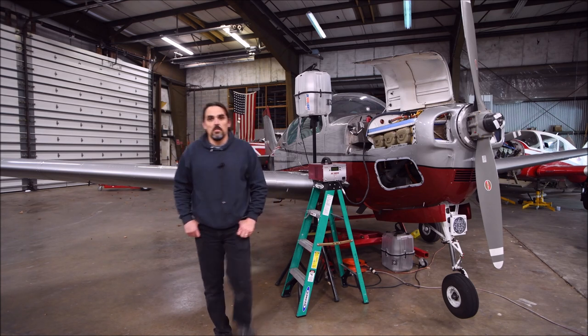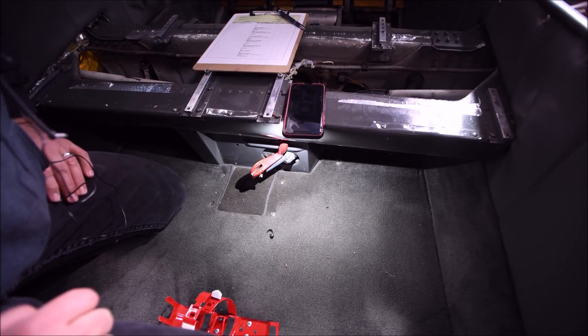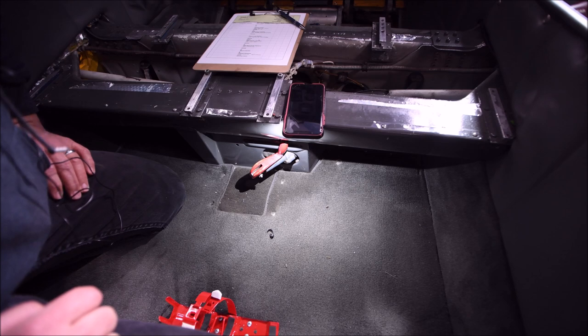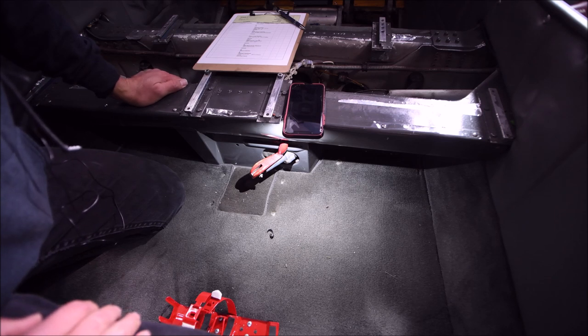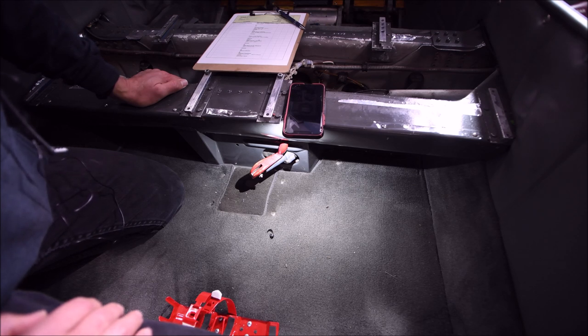On to our inspection. One of the first checks I do during the landing gear inspection, once the airplane's up on jacks, is the dynamic brake adjustment. What we're looking for is a sector gear in the gearbox that rotates 180 degrees, and the electric motor has a dynamic brake that stops the motor when it hits the limit switches. We want to make sure there is clearance between the internal stop on that sector gear and the internal stop in the gearbox.